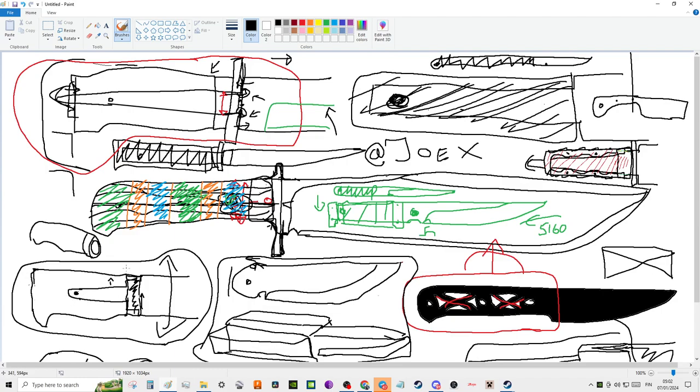This is a tried and proven method, this method here. This is a tried and proven method that's used all around indigenous areas of the world for making machetes and making swords and making very large blades, and it holds up perfectly fine, right? It's not a big deal. One thing you can do is dome the pin, or you can peen it down on both sides, and that'll prevent any sort of wood shrinking kind of problems.